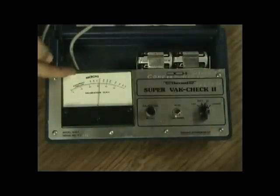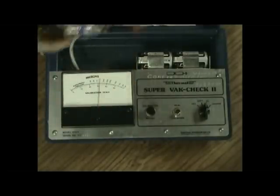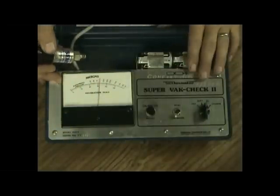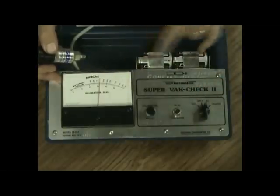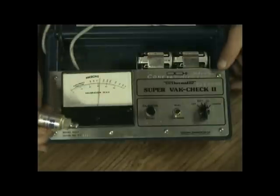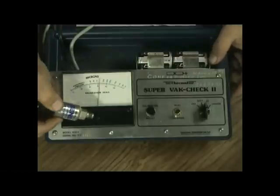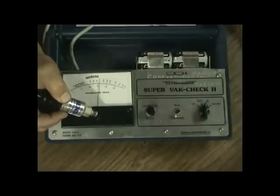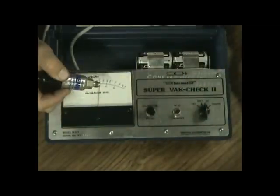There are two different scales: one for atmospheric pressure and micron level, and the other just for calibration with no bearing on anything else. The Thermal also uses a 120-volt plug-in or batteries. The issue with battery-powered vacuum gauges is that when the batteries get low, the reading starts to drift. The good thing about the Thermal is you can flip the calibration knob and get back into spec anytime the voltage varies.